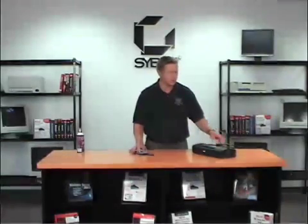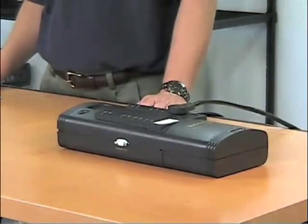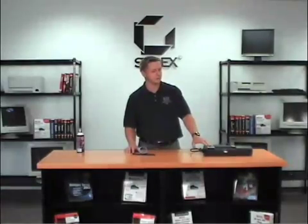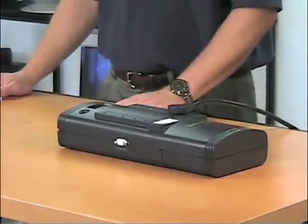Another safety item that you want to have at your disposal is a UPS. UPSs come in lots of different sizes, lots of different models, and you'll find them different ways. This is a very cheap model, but yet a very good one for home use or a small office. The reason that I brought it is because basically they all work essentially the same. What you'll see is that it has surge protection for all the outlets, and it has backup protection for half of them. This particular model is very good because it will also provide protection for your Ethernet jacks as well as phone jacks if you want to use it for that as well.